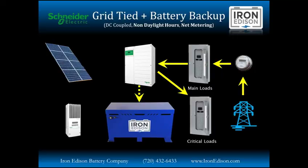If we do see that grid outage now at nighttime, as we see here in this slide, what's happening? The battery is the sole source of stored energy. The inverter takes that DC from the battery and converts it to AC and will supply the critical load panel.